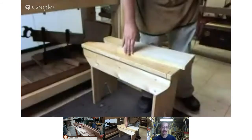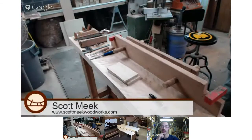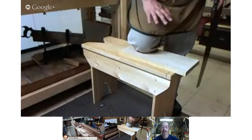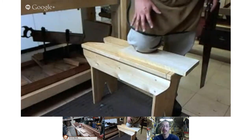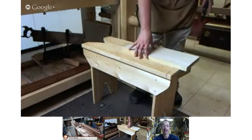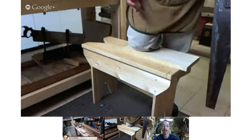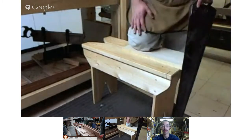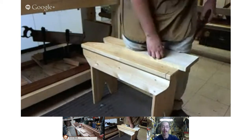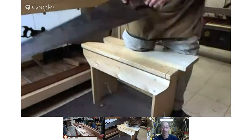All right. So, like the ripping event, they actually clamp the board to the saw bench, but it is a saw bench very much like this. There's a couple different heights as well, so you're looking for a saw bench that's at about knee height. I always put my opposite knee, I'm sawing with my left hand, so I put my right knee on the board, but I take my left knee and put it right behind my cut.